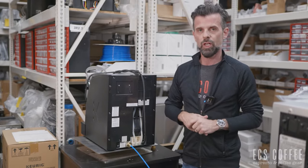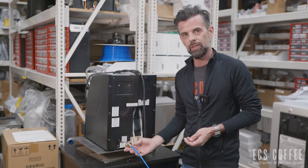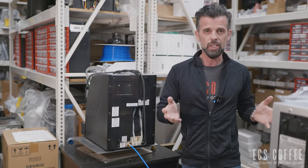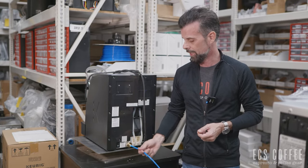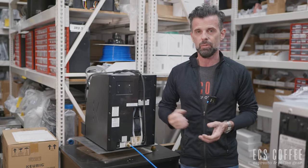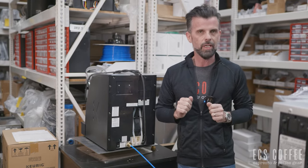Your machine is now plumbed in. Turn the water back on, check for leaks under the sink, and make sure there are no leaks at the back connection. If no leaks, turn the machine power on — it's going to start to pull water and fill. Check for leaks again and you're good to go. That's plumbing in a coffee machine for your office, particularly for Keurig — same concept works for a fridge ice maker and most coffee machines. Some people prefer threaded metal water lines; plumbers sometimes dislike this plastic tubing because if it ever breaks you can have leaks you can't stop. Those threaded metal lines are more expensive but an option. If unsure, talk to a plumber.